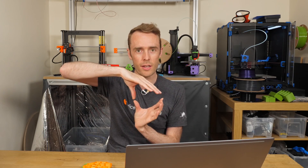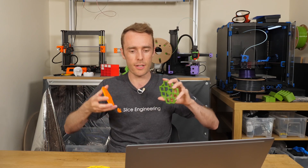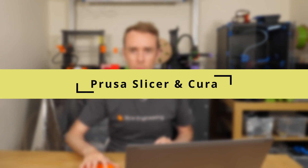The thing that can change is if you have a printer that's skewed — so if you can imagine a square with perpendicular perfect angles, if it's skewed it kind of becomes a parallelogram. If you're printing in that shape, that also gets skewed in the same way. But if you then rotate that shape and printed it in a different orientation, it would be skewed in a slightly different way. So if you have two shapes that should be perfectly square printed slightly differently in terms of orientation on the bed, they will represent slightly different skew in slightly different ways.